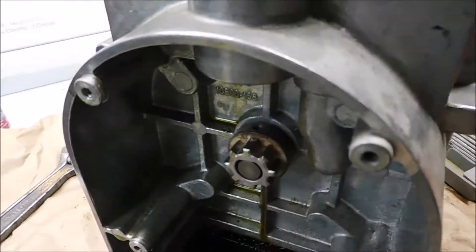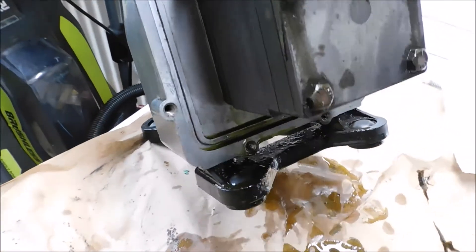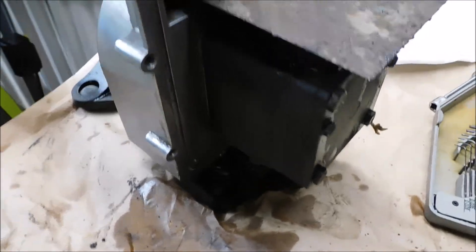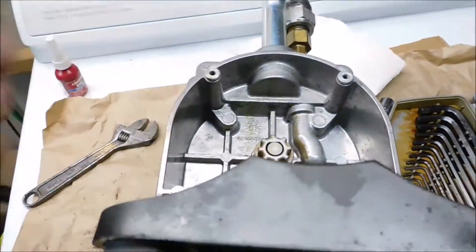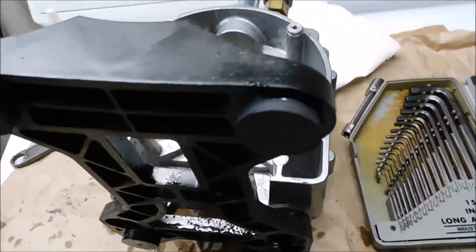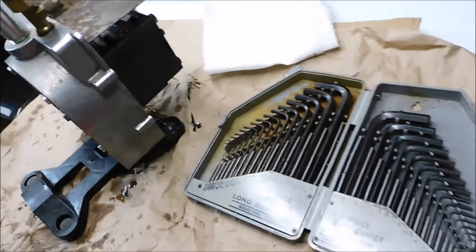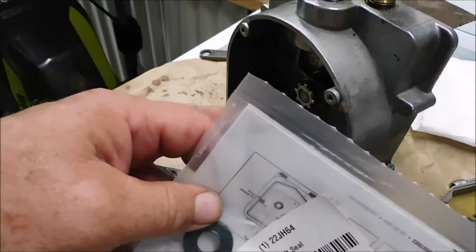I think I'll give that a shot of WD-40. Then this pump comes off the other side. The freeze dryer doesn't work too good without vacuum — it just wouldn't pull a good vacuum, and it was dripping oil. So I ordered a new seal for the back end of that — cost over $300 for a new pump, but I paid $3.02 for a new seal.